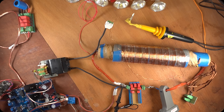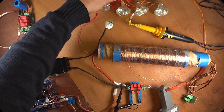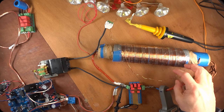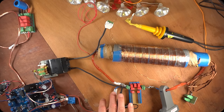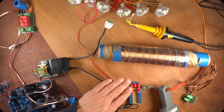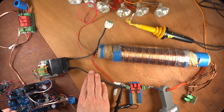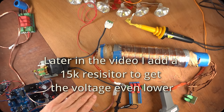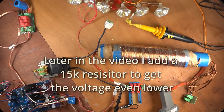Furthermore, I have a buck converter here that steps the 16.6 volts down to around 3.6 volts to power this delay chip and this transistor to get the right voltage for the TL494. Right now the load is connected to earth ground on this side and the high voltage coil is connected on this side. The parallel resonance will create a lower voltage on this side of the high voltage transformer. So I can get lower voltages here than I get there, and that's good because I want really high voltages there and lower voltages here so that my MOSFET won't be destroyed by high voltages.